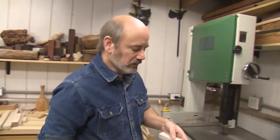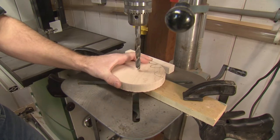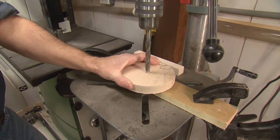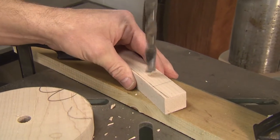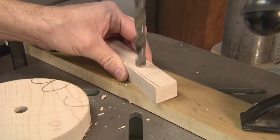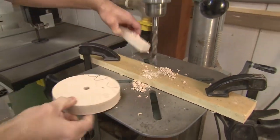The holes we're going to drill first are in the wheel and the wheel support, and they're half inch holes. I've got a scrap piece of wood on my drill press because we have to drill the hole all the way through — if we didn't do that, we'd have tear out coming through the other side. You can see I have a dimple there which marks the center of my wheel. I'm going to pop it all the way through. Now, this is the support that holds the axle which holds the wheel, and it also has a hole there. The wheel itself is five inches round, and this piece of wood is one inch square, seven inches long. We're going to make a six inch long wheel support out of it.